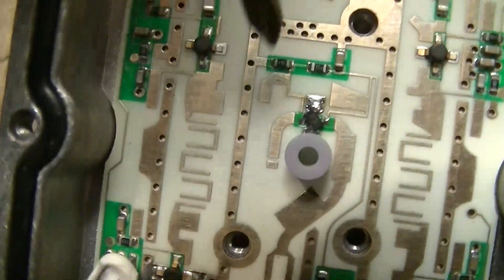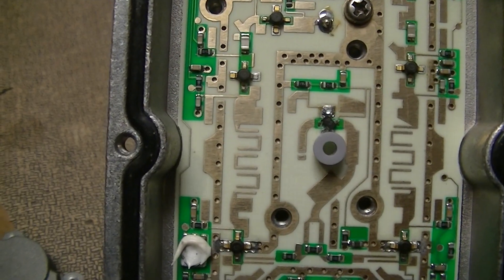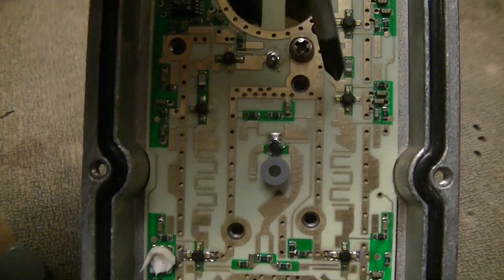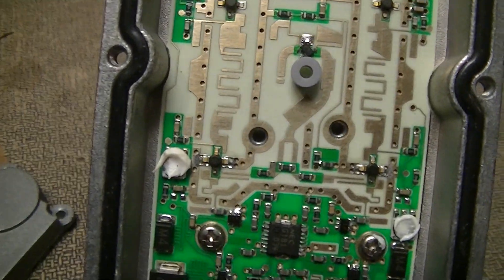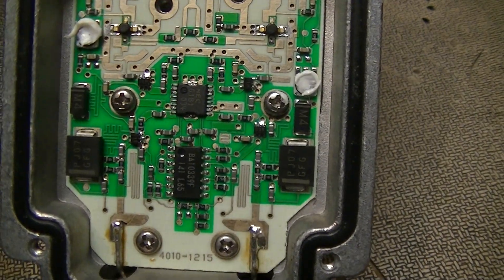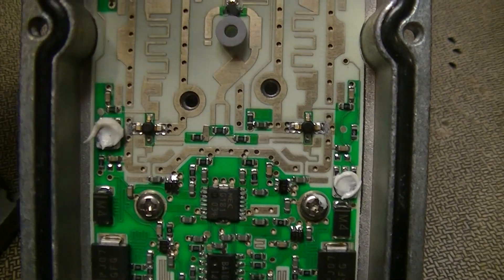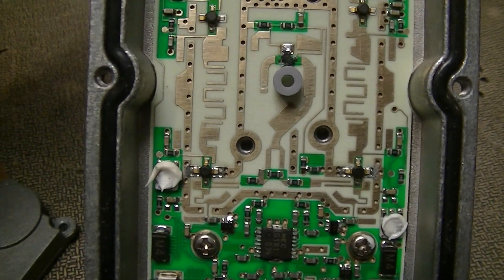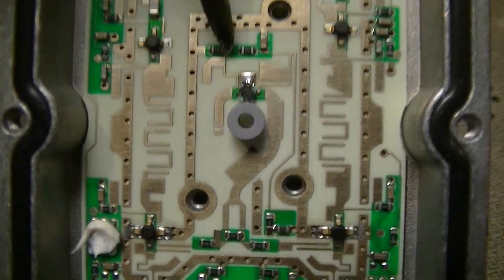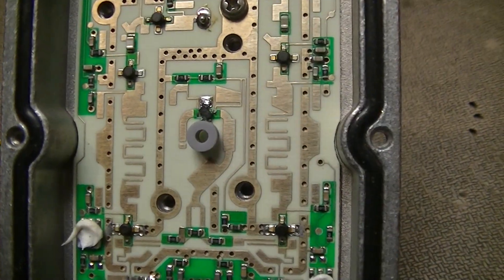There's this thingamajig which is, I'm guessing, some kind of intermediate frequency stage oscillator — just to provide, when mixed with the incoming microwave signal from the satellite, the intermediate frequency that goes down to the satellite box. Because this uses standard 75-ohm impedance RG-59 coax, which is not suitable for microwave-frequency stuff, it would obviously need some kind of IF stage to down-convert it to RF that can be sent on coax without needing waveguides or anything exotic. This tuning screw is probably just for fine-tuning the frequency.